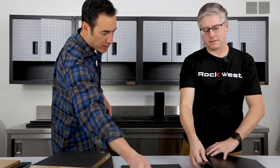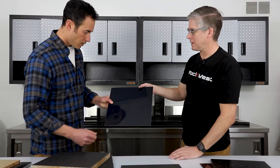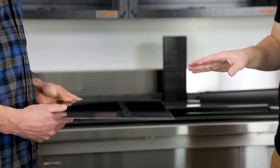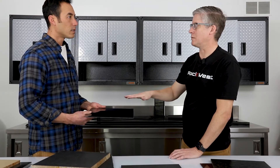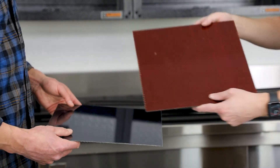There are also other colors — this fabric is a hybrid fabric where half of the fibers are carbon fiber and half are dyed Kevlar. Kevlar is more flexible than carbon fiber, so you're not going to get the same stiffness out of this panel as you would from solid carbon fiber, but it does have aesthetic value. Here's a red dyed one as well.